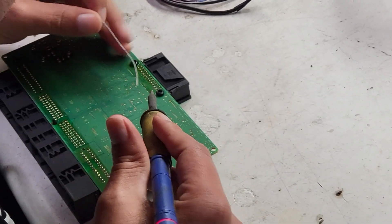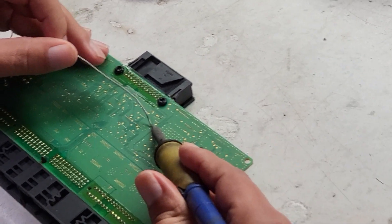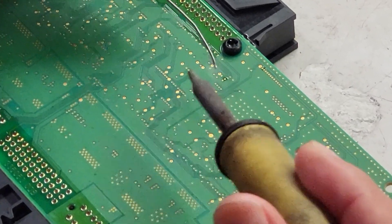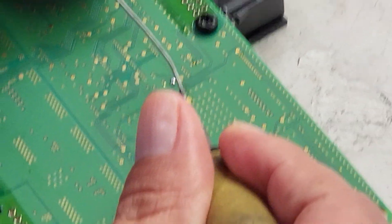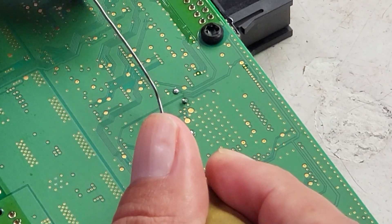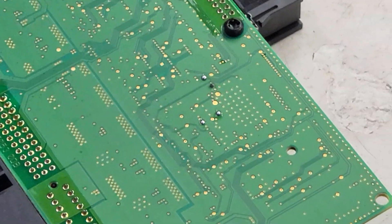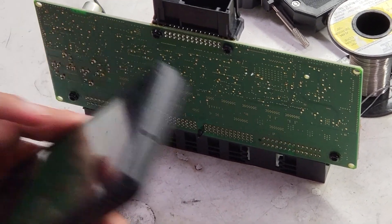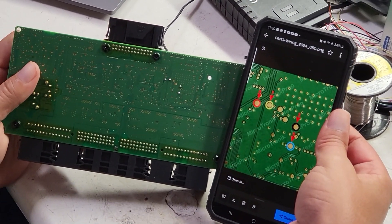For this you're going to need a soldering iron, some solder wire, flux, and some alcohol. We're going to prep the pads that we're going to be soldering on. You can see the solder points right there — that one, that one, and this one. Hopefully you can see it. That's what we're going to be soldering, and it should match the picture.